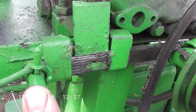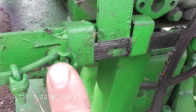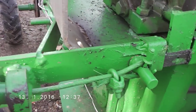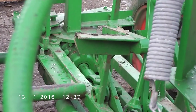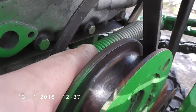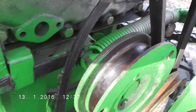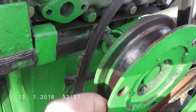On the end of this side of the lever, I welded a small piece of steel and drilled a hole here, and connected the steel wire. It goes back to my pedal for the clutch. For the clutch to return to the original position, I mounted this spring on the other side — and that's it, that's how it's done.